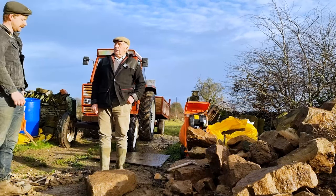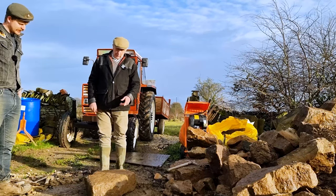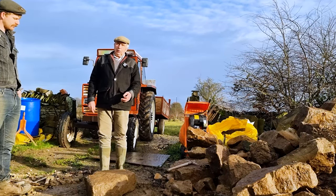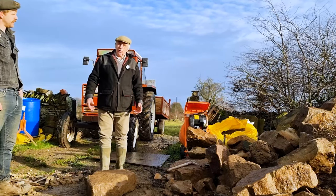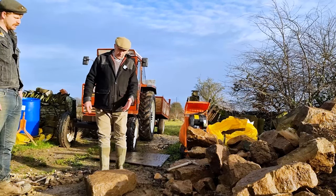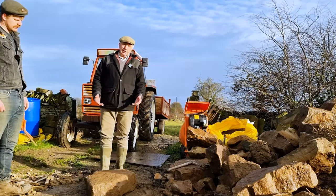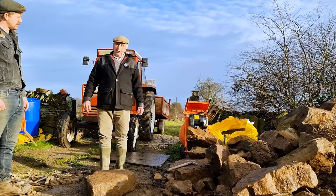So dad, what are you going to show us today? Well, this is cutting a piece of sandstone in the old way. We cut some grooves in, then put wedges in and break it like that. This is the way it was done in the past. All stone came out of the quarry in bigger pieces — it's like this has just been pulled out of a quarry and then cut up into sections so someone could dress it. This is the first stage.